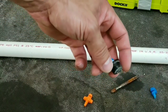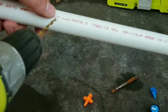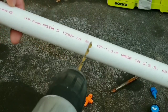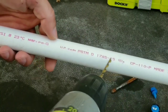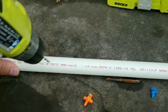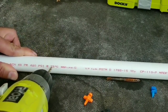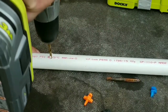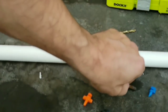This one will basically spray down. I'll show you — you want to pick a point along the pipe. I always like to use the guideline, the stamped writing on the pipe, as it's usually straight. I'm just going to drill right there — make sure you go up and down with the drill, not sideways, or you'll miss. And that's that.